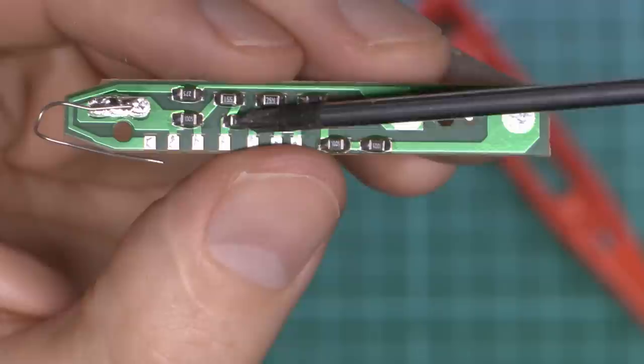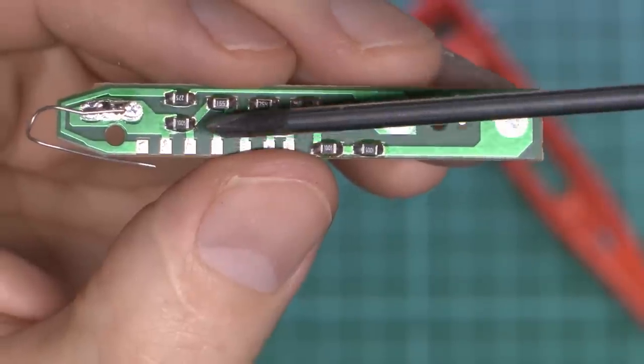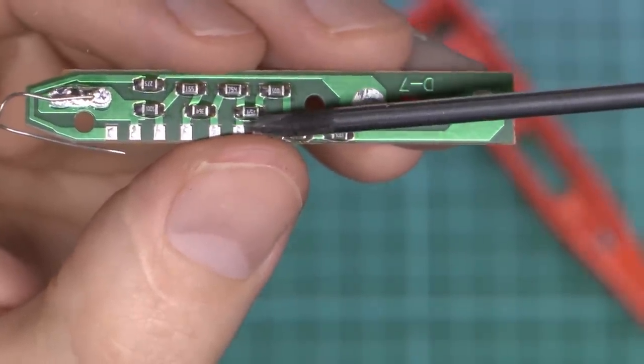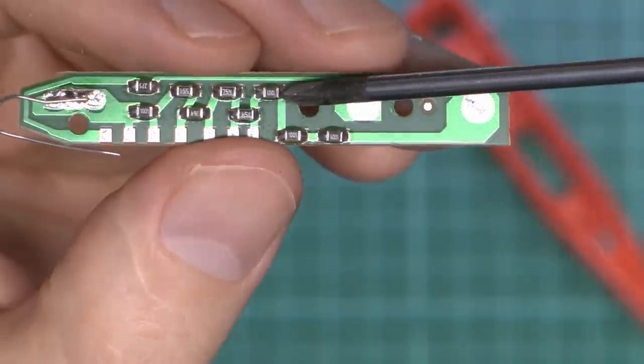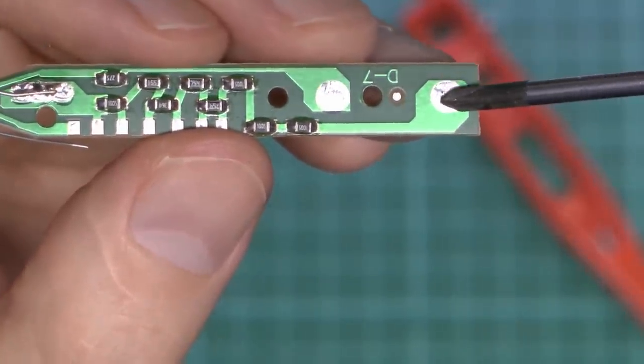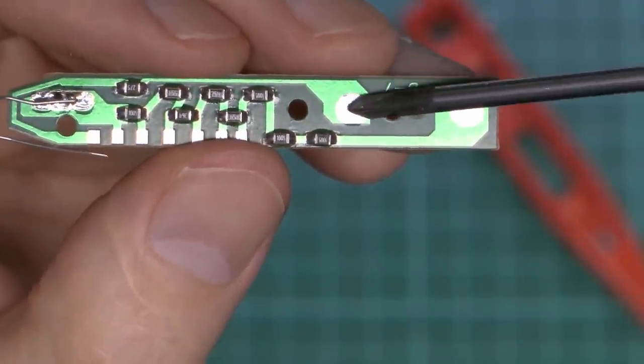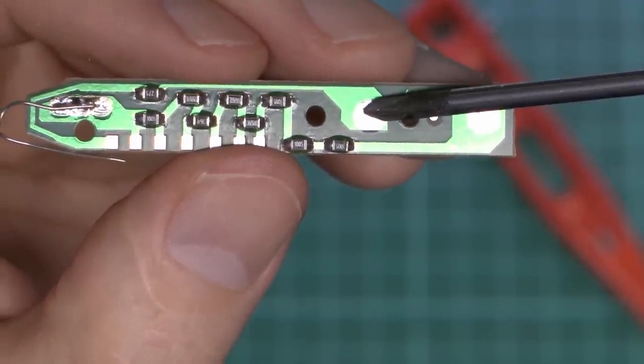And then we've got this chain of resistors here, which just basically goes along, and then you'll see there's taps coming off for each of the LCD segments there. And at the end of the thing, we've got a couple more resistors, and that goes up to the top there. That is the top button that's marked direct. And then this one is the one that says inductance on it.